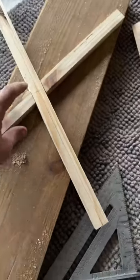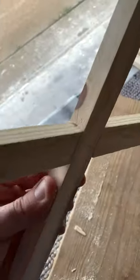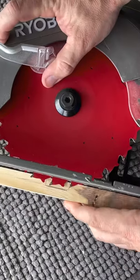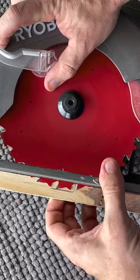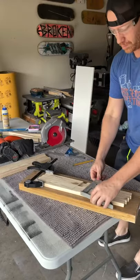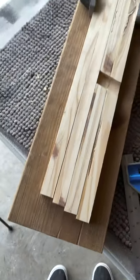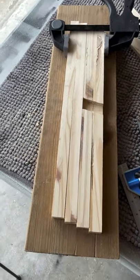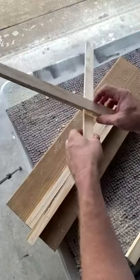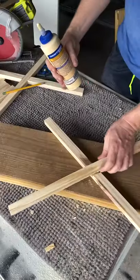Now for the tricky part. To make our cross braces fit together flush, we need to cut a one-inch wide notch halfway through the board. If your board is three-quarter inch thick, set your circular saw depth to about three-eighths of an inch. That one-inch notch goes right in the center of each board at 10 inches — half an inch on either side of that 10-inch mark. Using your circular saw, go to town and make that notch, then fit them together and glue them up with wood glue.